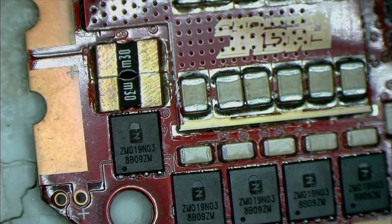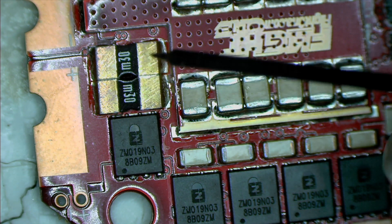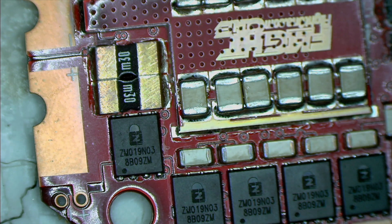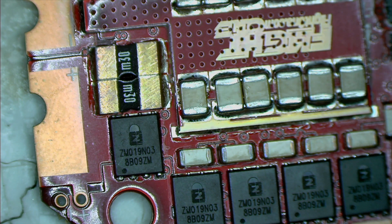We've moved to a single current sensor. We used to have a current sensor on each channel of the board, but we found that introduces delay since it comes through telemetry. We have some things we're going to be doing with current sensors soon, so we wanted to be as fast as possible. This is actually an analog sensor that feeds directly into the flight controller, so it's about as fast as you can get.